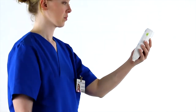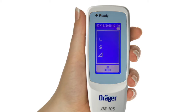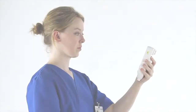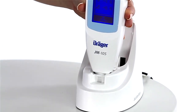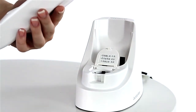On the main JM-105 display, select Checker. The screen displays three vertical symbols — L, S, and Delta — indicating that it is ready. Position the JM-105 measuring probe perpendicularly on the surface of the checker. Gently press downward until a flash is emitted. Lift the JM-105 and observe the display.